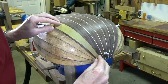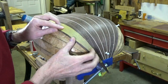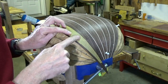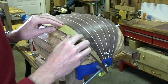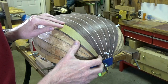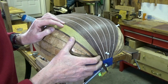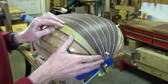I've removed more material here and a little more here to get the joint more congruent with the previous rib. If I press the lute rib down against the mold and move it, it hinges at this point — meaning I need to remove material here, even cutting into the template, to make it completely flat so it will meet at both end points. Even a very small amount removed here, just a few shavings, will cause the disparity at the other two end points to close up. It's amazing how little material needs to be removed — it's extraordinary. I always seem to take too much; I should discipline myself to remove only one stroke at a time, but it's a delicate balance.